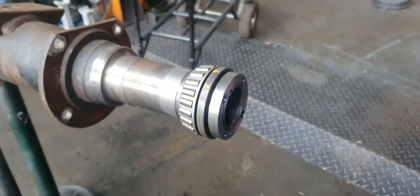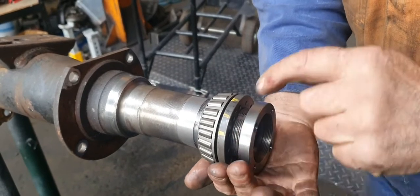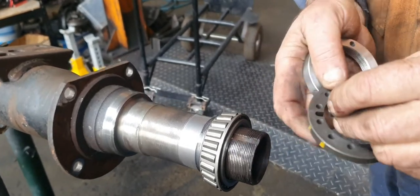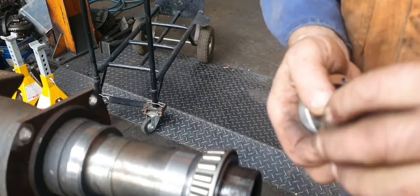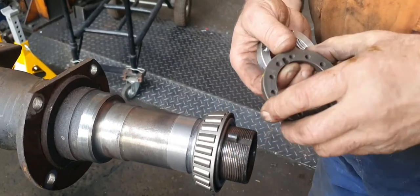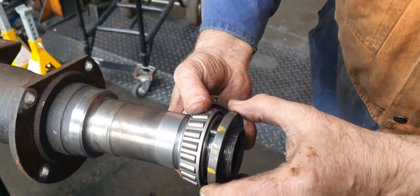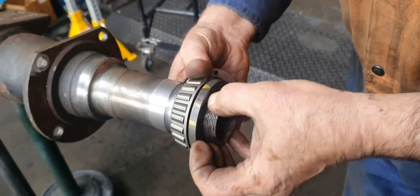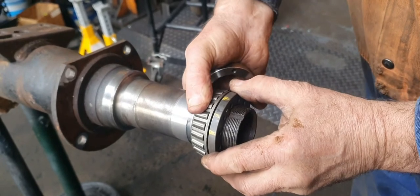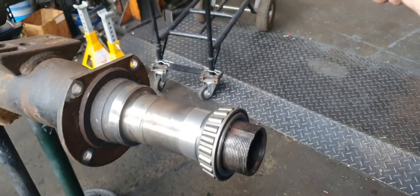You've seen what they have in these things. They've got this little channel wedge, knocks along here, and goes in. This is stock material. It's 5mm material, and you just grind it until it's the right height. 5mm keyway they have in these. So that can't go any further, and with that washer there, like that, it prevents the bearing, they just gradually skid around on these. But it'll have no influence to unscrew that nut. So they work all right, those things.